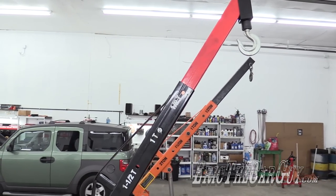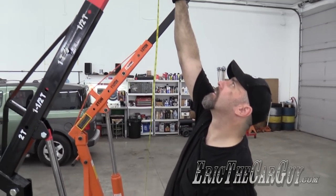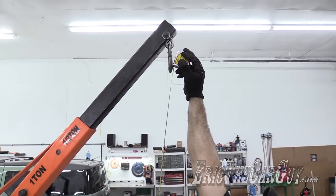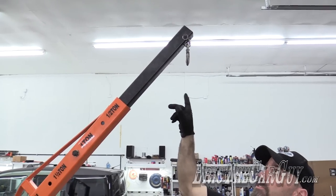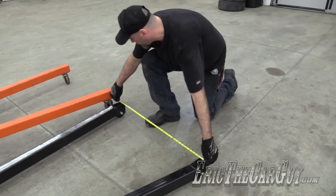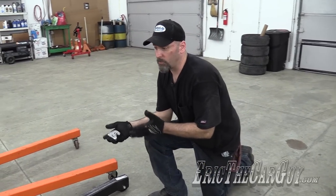With the booms fully extended in the one-ton position, the SunX goes up about 90 inches to the bottom of the hook. The Harbor Freight's hook is sitting slightly different, but it's also roughly 90 inches — so they're both about the same. However, if you buy it new and don't modify it like I did, it's going to hang down about another four inches, so you won't get that height out of the box. The leg spread on the Harbor Freight is roughly 35 inches, while the SunX is about 38 and a half. The wider spread really adds more stability.